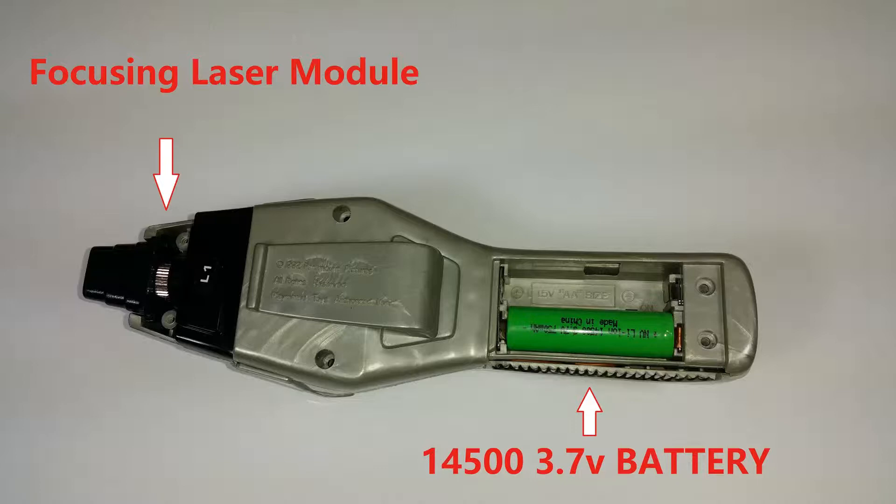So I had to eliminate the AA batteries entirely. AA batteries, just like in a flashlight, are wired in series — stacking one on top of another to multiply their power — and a lot of devices are wired that way. I needed to change that to parallel wiring and upgrade to the 14500 3.7 volt lithium battery. One of these batteries has more voltage than two of the AA batteries, and that's why I only actually have one in the phaser right now. I'm afraid that if I put both of them in, I'm going to blow out the circuitry, because although they're wired in parallel — meaning I'm not doubling the 3.7 volts — I would be doubling the current, the amperage, and as a result might fry the phaser's internal workings.